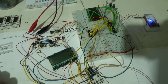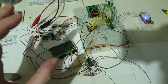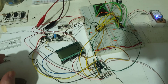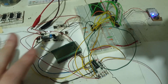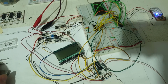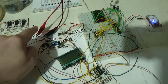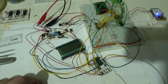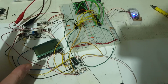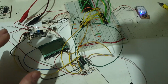And yeah, don't try stuff on the final board, especially new stuff, new components. Test them first and then lay them down after testing, after you are completely sure they are working, because you will go crazy believing you are stupid, and in reality, they are the problem, the little fuckers. So this is it for now. Like I said, I spent a ton of time trying and undoing and trying to figure out where the problem is.